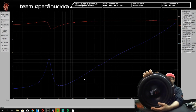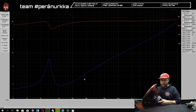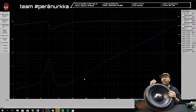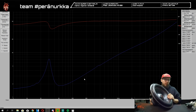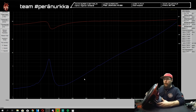So that was the Ural TT. My opinion here is that it is an okay subwoofer meant to be played low. So I will definitely recommend this for everybody who wants to make a really big enclosure with just a single or two or four of these subwoofers and play only low notes. It will handle that quite well with low power. You can put from 600 watts up to 1000 watts RMS, because the box rise will help you out. In a 4th-order bandpass, I don't see this subwoofer being okay, but in normal ported boxes or 6th-order bandpass, this should be an okay driver.